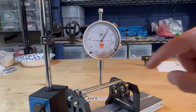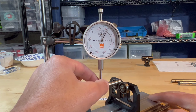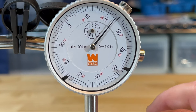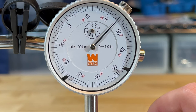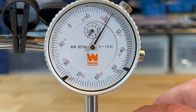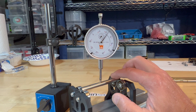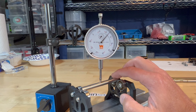I'm going to replace the brand new shaft with a spindle shaft that was involved in a crash. Once I spin it — oh my goodness — the dial is moving all the way from about 20 to 25. This is a shaft that looked pretty good when I rolled it on the glass and spun it on the Dubro True Spin, but as you can see, this shaft is really no good according to this test. The other checks suggested it was fine, but it's certainly not — so this is going to go in the trash.